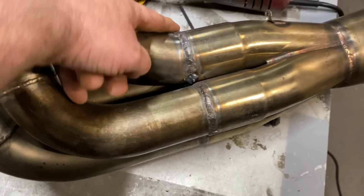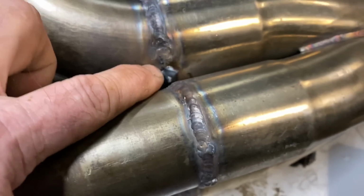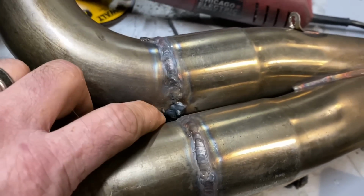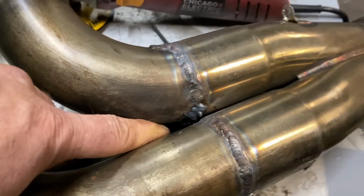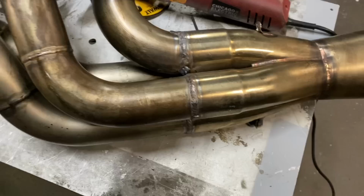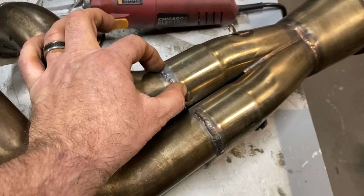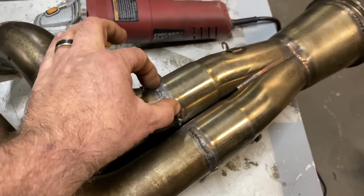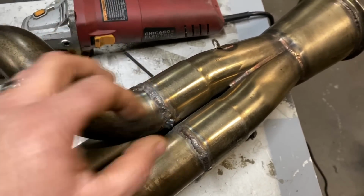And then when I got down to the last two tubes, you can see I gobbled up some MIG there because I couldn't get down there with the torch. I was trying to hit it with a MIG welder, and essentially down in the very bottom, you couldn't get to it. So the last tube has got about a 1/2 inch of unwelded pipe. It may swell up, but it may not swell up because it's welded almost all the way around.